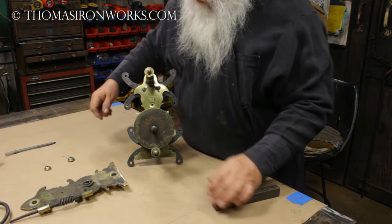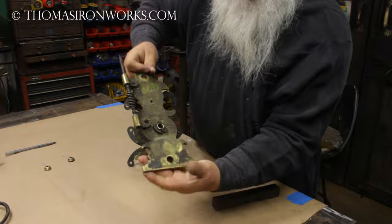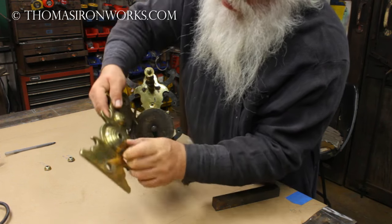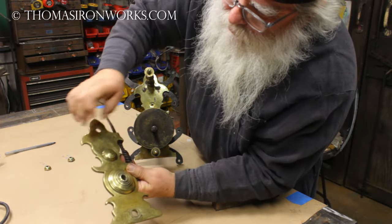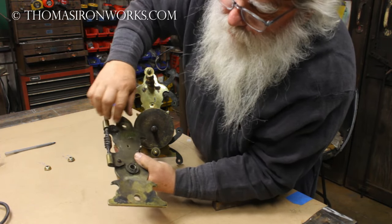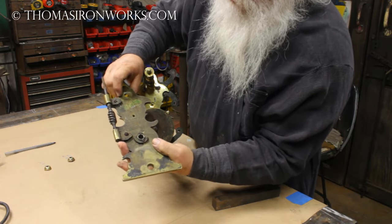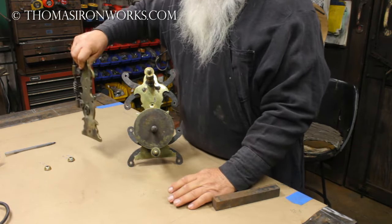Let's look at the backside of the front plate. See how this is where the worm screw is mounted on here. I think this is really interesting - this was turned. You see this piece was turned and tacked on here - how fantastic is that? You can even see the lines where this piece was turned as well. They were turned and then it's like a press fit right in there. We'll clean that up and we may end up seeing little dots where they center-punched to squeeze it tight on there. Sometimes that's the case.